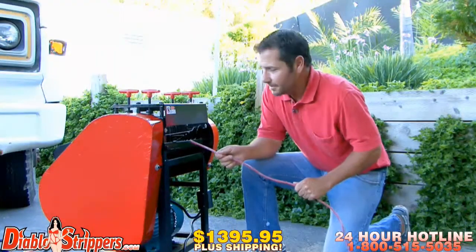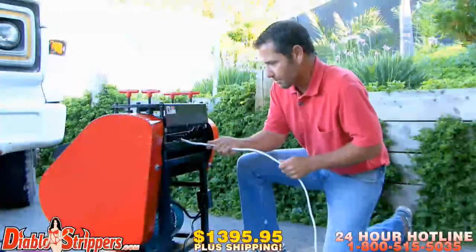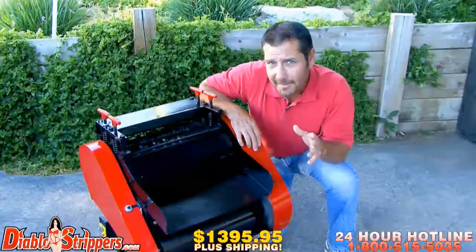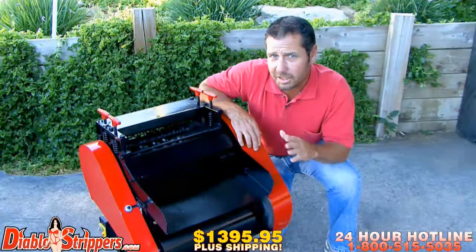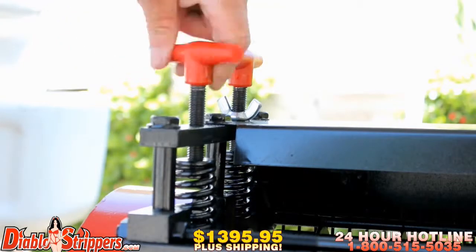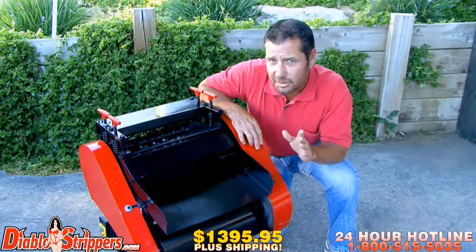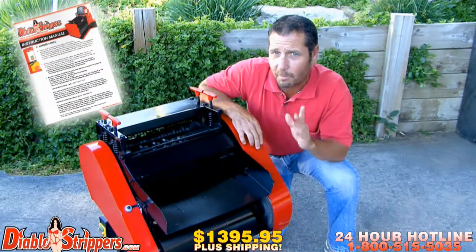You want production? Check this out. Keep in mind the blades in the Diablo 2 are fully adjustable. If you notice the cuts on your cables are too deep or too shallow, you can easily adjust this using the blade adjuster. Make sure your machine is unplugged when making these adjustments. These adjusters are specified in your Diablo 2 wire cutter instructional manual.